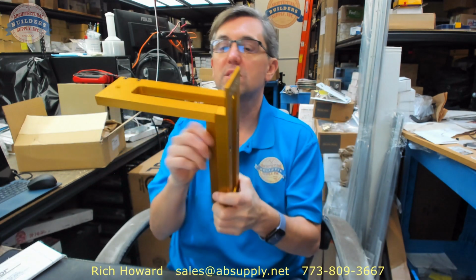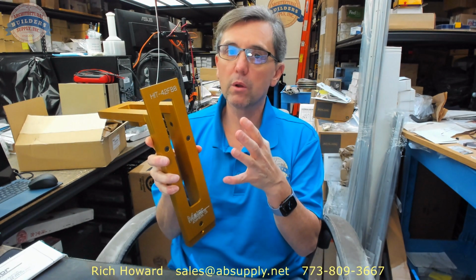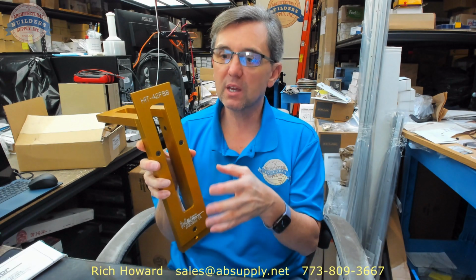The problem with corner style wood door flush bolts is if you have a 9-foot door, you're certainly not reaching up to the top of the door to flip the lever to disengage the bolt or re-engage it. You're certainly going to be thinking about automatic flush bolts at that point, is what you're going to want to probably consider on that.